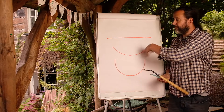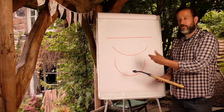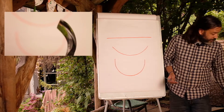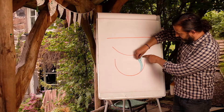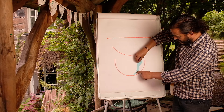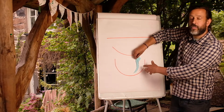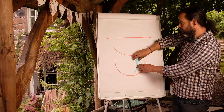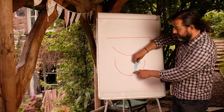Okay, so we've covered curved blades and hollowing out a spoon bowl. If you want to go deeper, although some spoon blades will do it, the swan neck gouge which I've designed is really good at this, and I'll talk a little bit about the edge geometry behind that. This is a cut-out cross-section of the blade, and you can see that we've got clearance in the swan neck portion which allows you to cut and have some degree of guiding with the bevel — you can get at least halfway with that. You don't need absolute guiding with a swan neck gouge in general because you've got a big handle which provides support, and the main thing is that the bevel is largely following the cut or at least providing clearance for the cut.